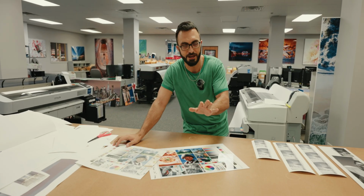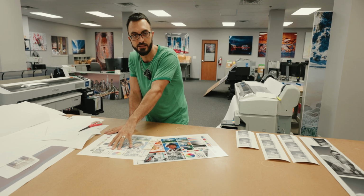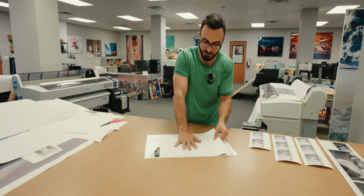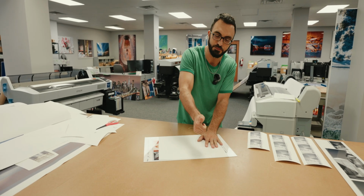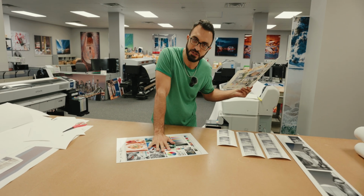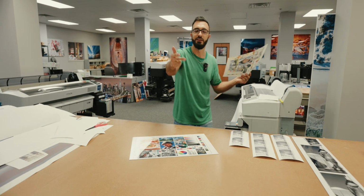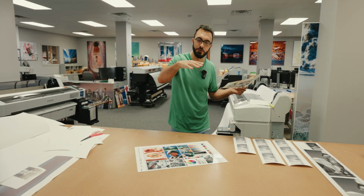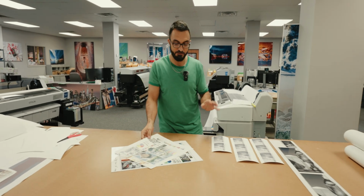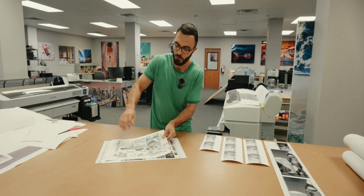So our inks actually come in as a liquid, right? And then they get sprayed as a solid into this high release dye carrier paper. Then when we tape this to the metal, it turns into a vapor. Then it goes back into a solid after it's pushed into the metal. And so it goes liquid, solid, vapor, solid. And all of those phase shifts cause color changes. And very often you cannot tell what's going to happen to the color when it's on paper.